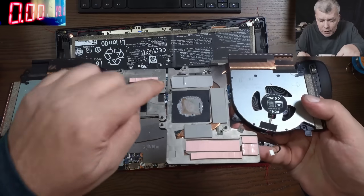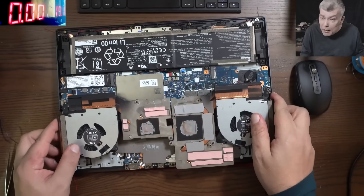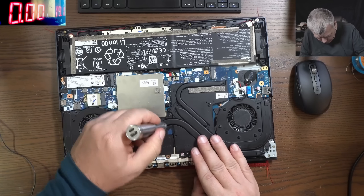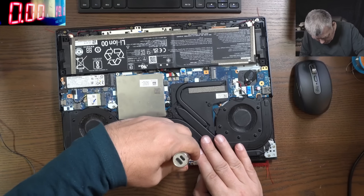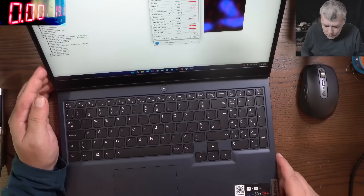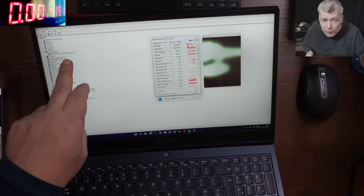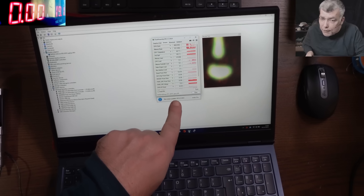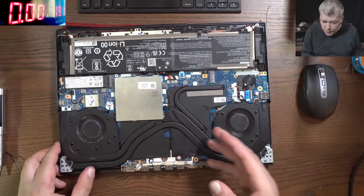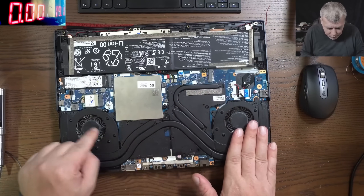You can see on the middle how the heat affected the thermal paste, even on the CPU. So let me replace the thermal paste quickly. Everything is fine — I started a render test and the GPU is working great. No yellow warning sign on the GPU. It's an RTX 3070 — some people thought this died because it was AMD, but no, the GPU is an RTX 3070. Slightly warm — perfect. I just have to clean the fans and that's all.